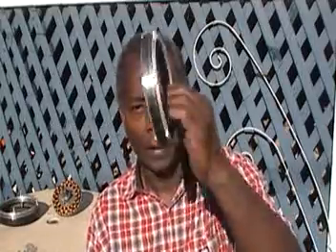We will strictly restrict ourselves to the other two parts. One of them is the rotor. If you've watched my video entitled 'Ceiling Fan Alternator Rotor Removal,' you know how to take it out. The rotor is a ring of metal — they come in different shapes, sometimes with little extensions all around. Once you remove the rotor, you are left with a circular path, and in that circular path you have to add magnets. That's the problem we will try to solve today.